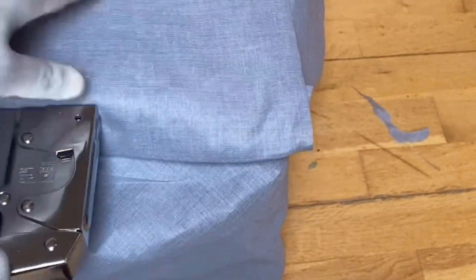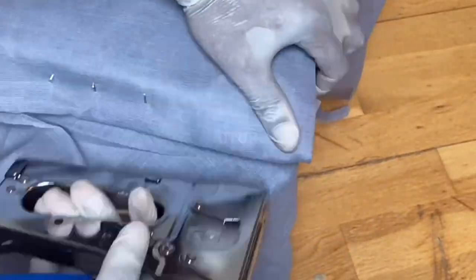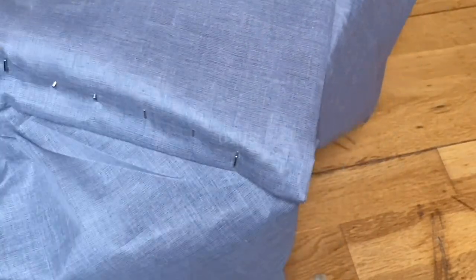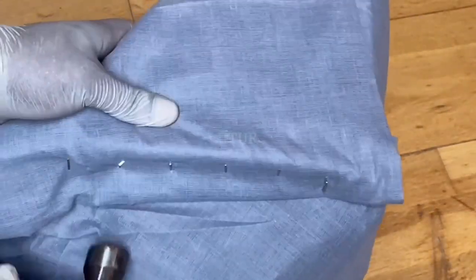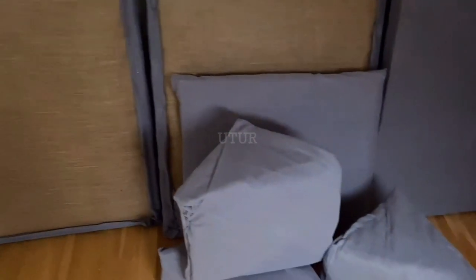I will be installing the breathable clothing with a staple gun onto the picture frame. If the pins are not flush, make them flush with a hammer. Also make sure that you're driving the pins into the wood frame as opposed to the clothing.